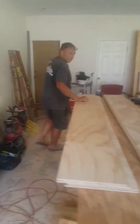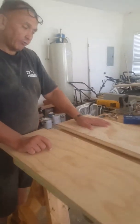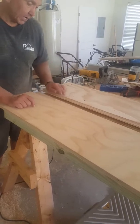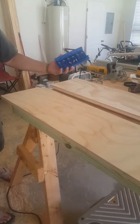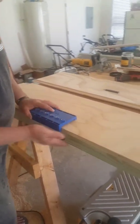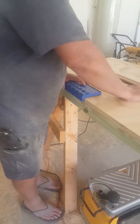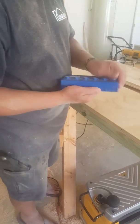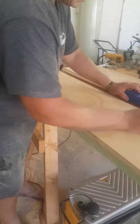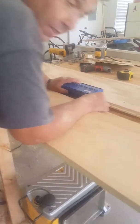So what I've already got on this kind here is - you get your sides, lay them out, get your height, and figure out where you want your shelves. In this case I went 12 inches apart on each shelf and drilled up to the 12 with my Kreg. If you want your jig and you have it offset, like this side would be the face side, so I'm going to have the offset closer to the front. And since the back side is rabbeted, I reset the jig - all you got to do is snap it, pull it over here, snap it back, and you can put it down. And it'll offset instead of putting your pins at the very back of the cabinet.